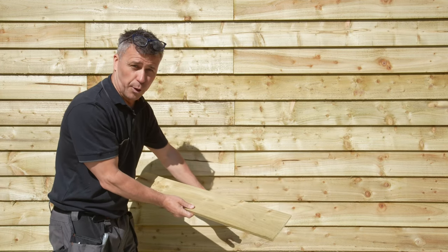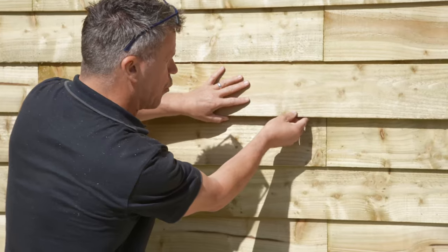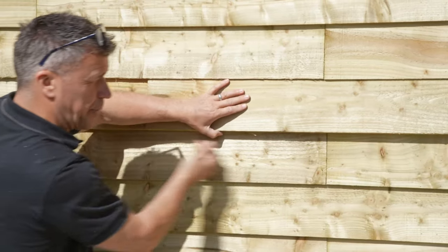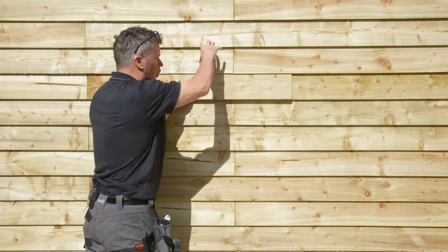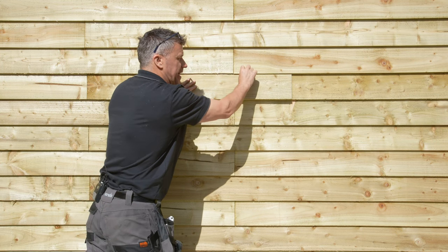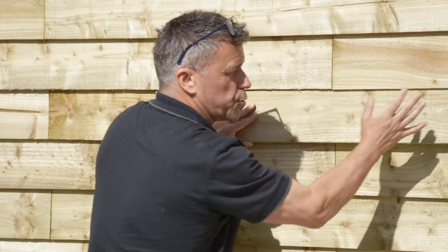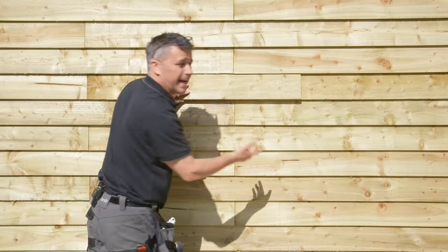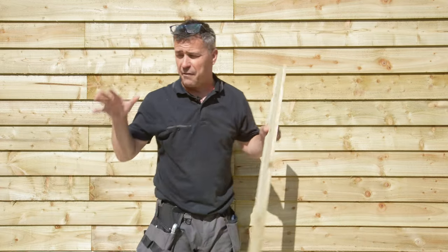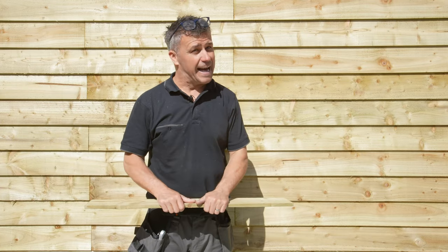And then your second board, and every one after that, you place one of them over it. You feel along the bottom here, making sure that it meets the bottom both ends. That way you know the one that you're mounting on top is level, and you've got this same size gap with that 20 millimeters cut off. So the next board you're putting on is lapping over it 20 millimeters, which is what you want. And then get your nail gun and fix that into your frame. The next stage is my four corner posts to be cut down to size, fitted in place and leveled.